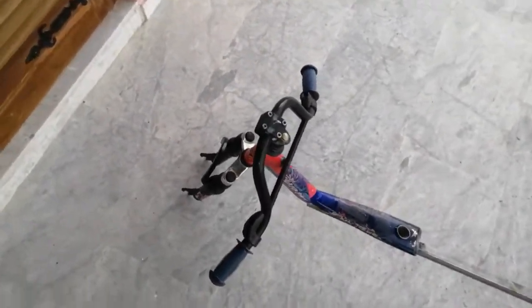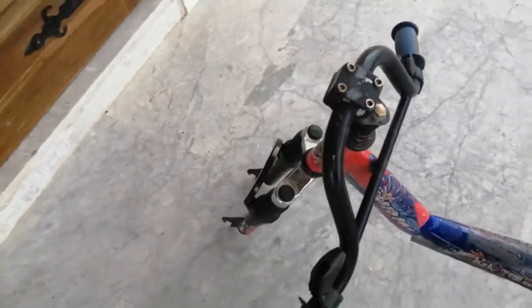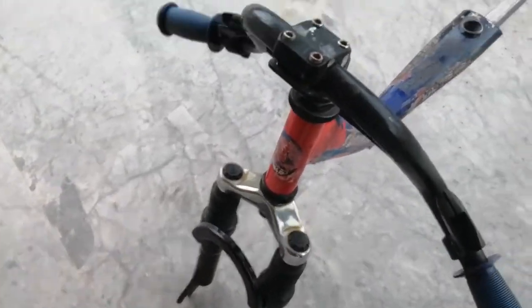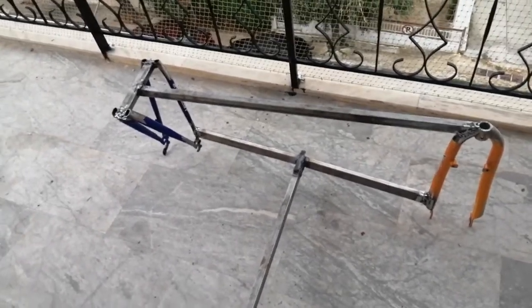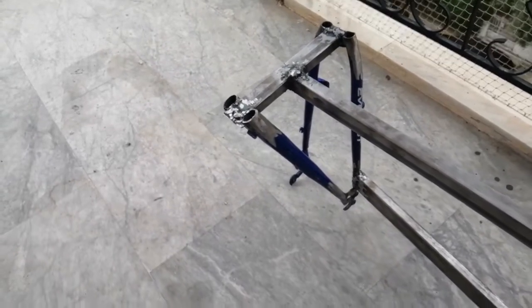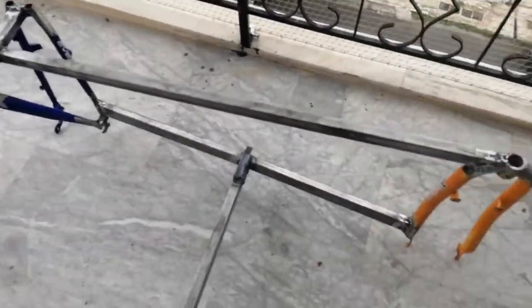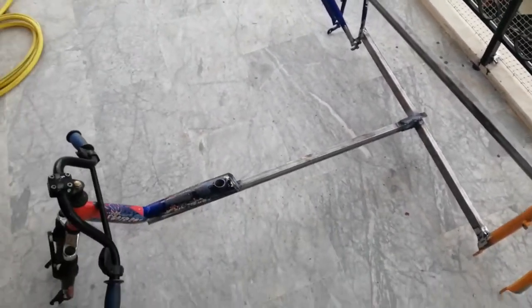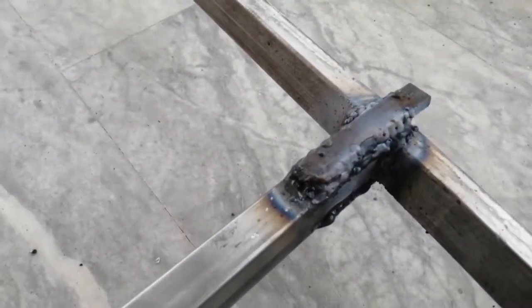Here we are another day later. I've turned the handlebars backwards using those adjusters, turned them back to be feet-controllable for the kite buggy. There's the front fork welded on, and today I've welded on the back section. My problem is it was a front fork and a back fork which are completely non-compatible, so it's all a bit higgledy-piggledy and skew-whiff. But I'm hoping the wheels will point straight enough forwards. I'm now going to figure out a bracing pattern and add that on. Ugly, but hopefully functional welding.